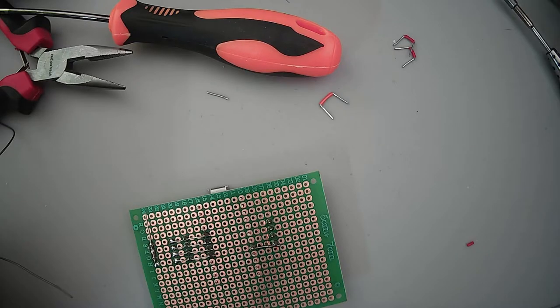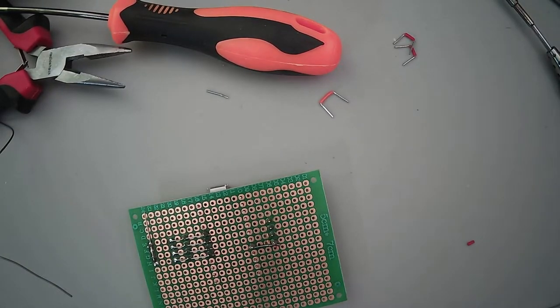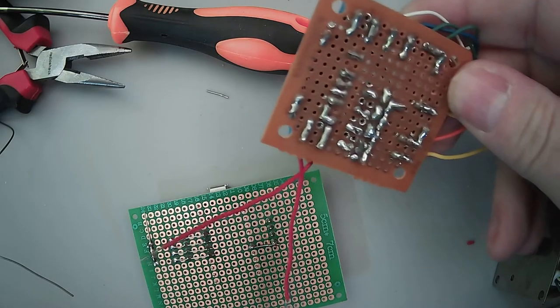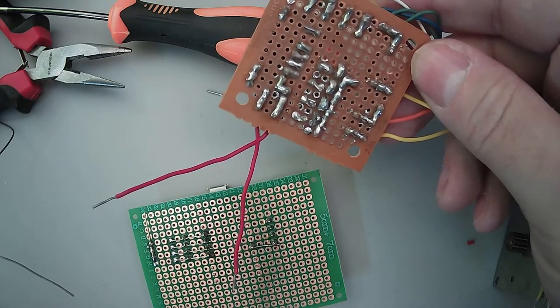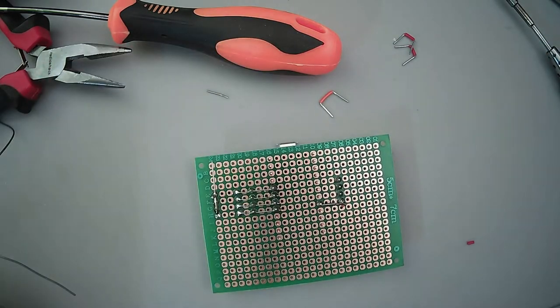If you're going to get a soldering iron, no matter what you get, whether you get a plug one, a cordless, something like this, make sure it's temperature controlled. Mine is not. It's on, it heats up to whatever temperature it is. You can't control any of it. That is the difference. This was a 15-watt pencil soldering iron from Radio Shack, I believe. And this is a temperature-controlled soldering iron so that you know what temperature you're working at.